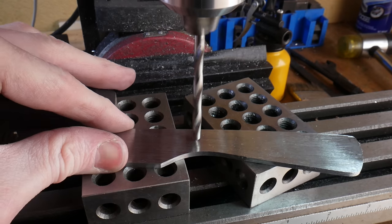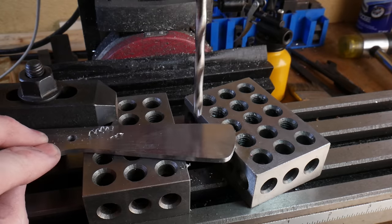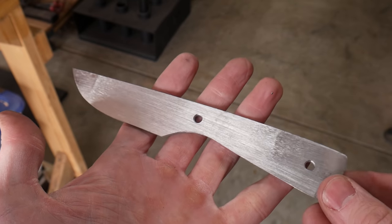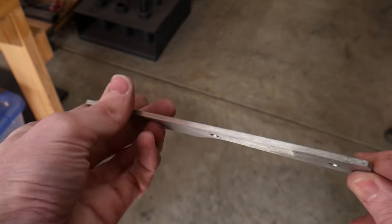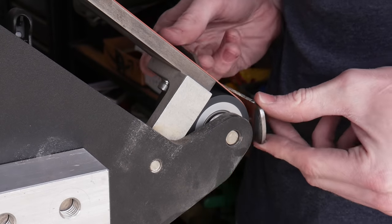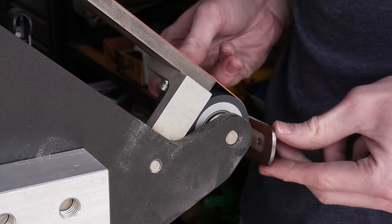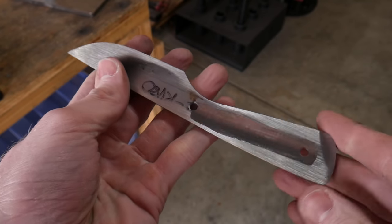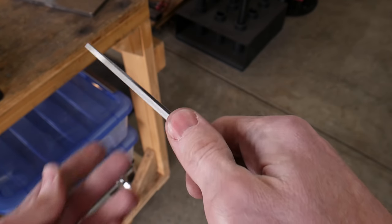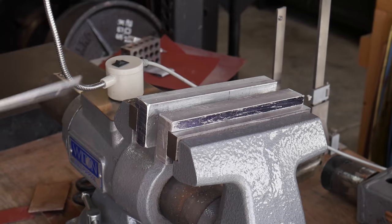As y'all have seen up to this point, we have the blade drawn out, cut out, and ground out. Now this profile is my most aerodynamic profile. I put it in a 3D CAD program that has an air tunnel function and this thing performed the best — not only will it cut the best but if you drop it out of an airplane it will be the most aerodynamic with the least drag. I like putting a hollow in the handle on one side of the knife and we'll get into why I do that later. After we have the hollow in one side and the rest of the blade ground out, we're going to be putting the jimping in the spine.